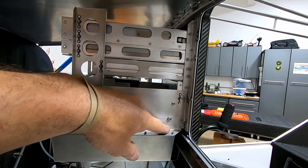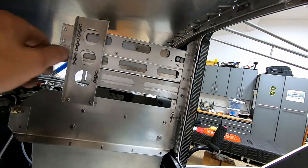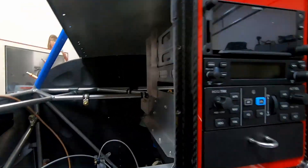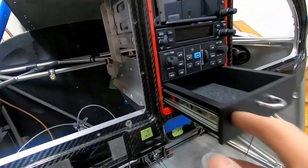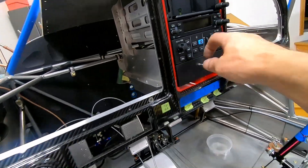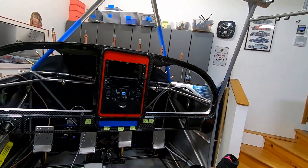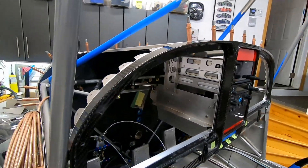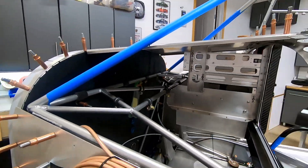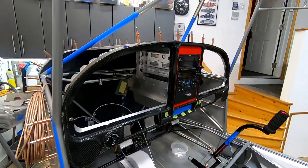Nut plates wherever I could. The cinch nuts can be problematic sometimes, so you just have to start them all by hand and take them in and out by hand. George has the G3X panels. I like the drawer — it has a lock so you really have to tug it and it can't pop open during flight. Good place to put sunglasses, oxygen — no keys though. This took a lot longer than I expected, but I want to get it back to George so he can continue with the wiring. I'll be back on the center console. Thank you for watching. Happy flying.